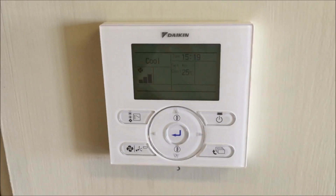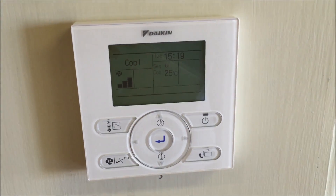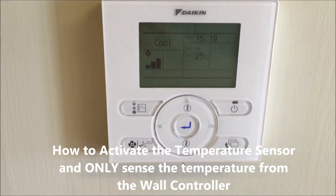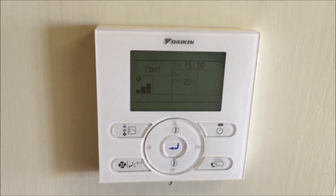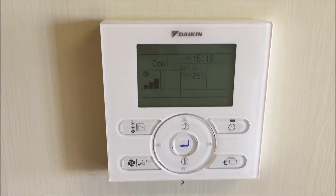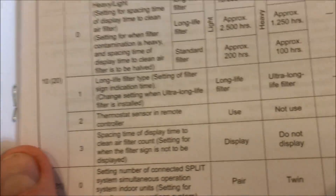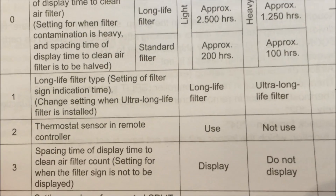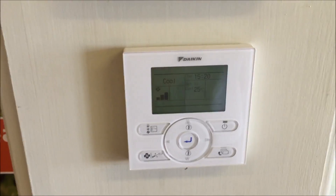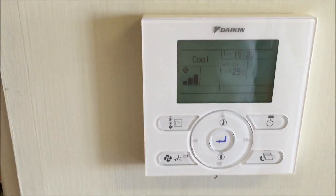In this video we're looking at the Daikin wall controller BRC1E6-1 and 1E6-2. This is actually in response to a previous video we did about how to activate the temperature sensor in the controller itself. One of the comments noted that was actually the incorrect code — we followed up with Daikin tech support and they confirmed that. So despite their installation manual listing code 22 for thermostat sensor and remote controller, and not mentioning code 2203, we're going to run through the actual correct procedure to clarify that.